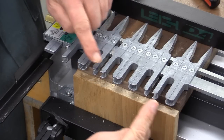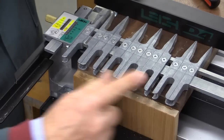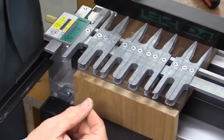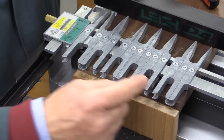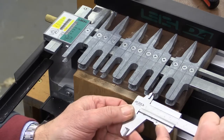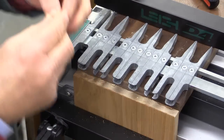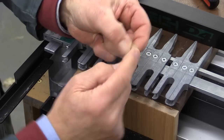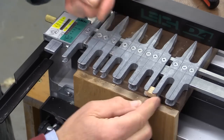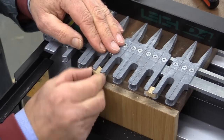We've now got a symmetrical layout: a full finger, a split finger, and full fingers — a nice symmetrical pattern. I'll use the same approach for each of the other two sizes of drawer in the pedestals. Then I measure and cut distance pieces of the appropriate size, rounding off the edges at the front to conform with the shape of the jig finger piece.